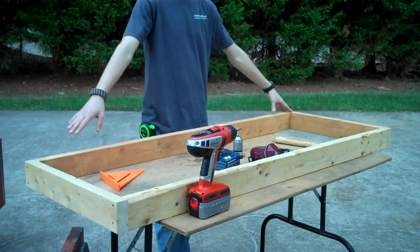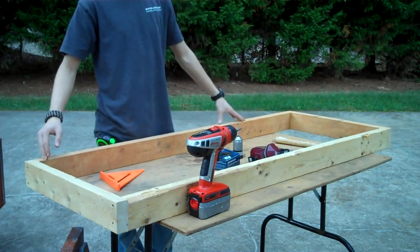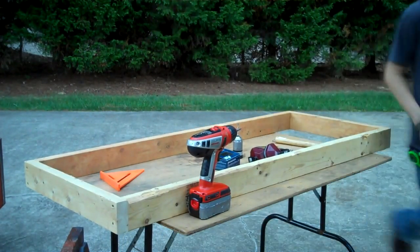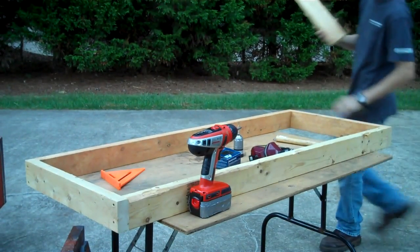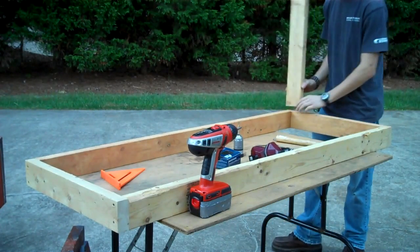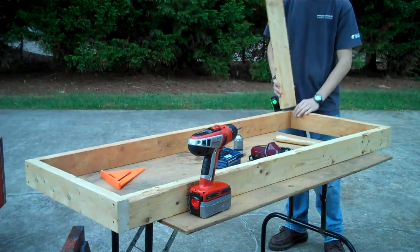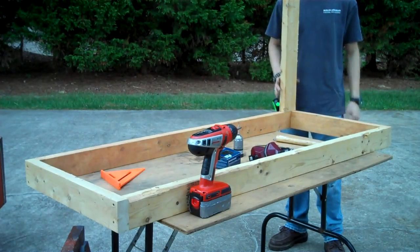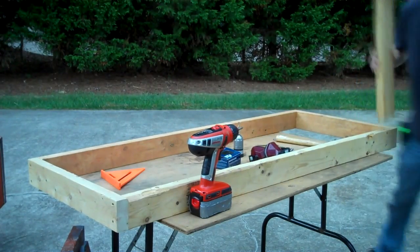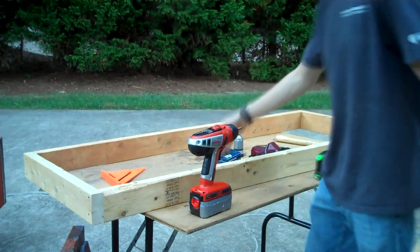The overall length is 60 inches wide and 24 inches deep. I cut the cross pieces at 57 and the sides at 24 inches so the legs bridge the gap between the two pieces — that makes it a little bit stronger than running boards all the way through. Next we'll cut the inside pieces at 14 inches from the inside edges to position the interior supports.